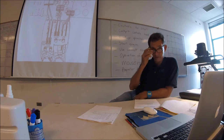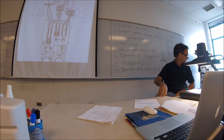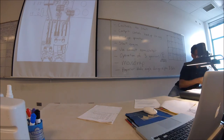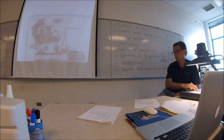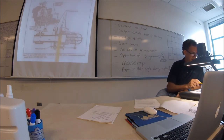Basically, when you go into reverse, that whole linkage shifts forward. Yeah, so it opens to allow the piston to go into reverse. Okay, so it basically allows more oil pressure to flow through. Well, first of all, when you go to reverse, automatically your linkage shifts. And that slip ring moves forward. Even though this is not ours, this is pretty good, because this one shows the linkage from the power lever. It shifts, so it allows that feedback ring to go forward.